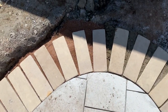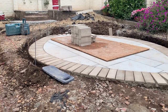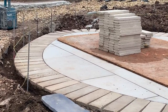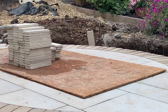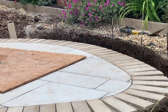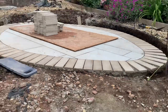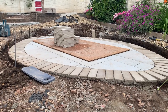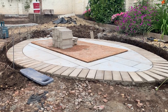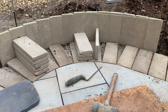I'm going to crack on with the retaining wall around the oval today. I've put tent poles right around the outside — that's the highest point at the back area, and it's going to gradually get lower and lower to this point here, which will be the entrance into the patio. Heights are sorted; I've got to make a mix of concrete now and bed those in so they're nice and secure.